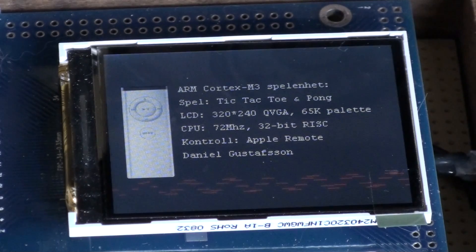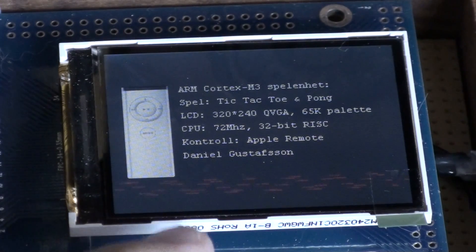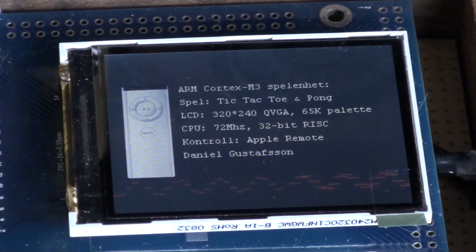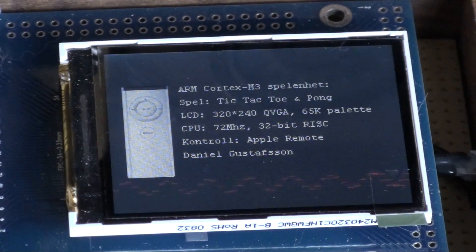You can pump up the volume of the music in steps. As you can see, it's an interrupt-based sound player. Because when I push a button on the remote, it has to handle some interrupts, so it can't play music, check the remote, and draw to the display simultaneously — it's almost simultaneous. But because I don't have any scheduler implemented, it just takes time whenever it gets time, and then does the function that the interrupt told it to do.